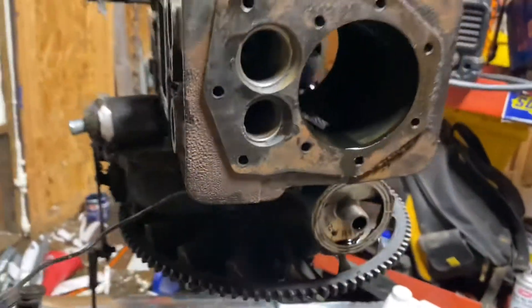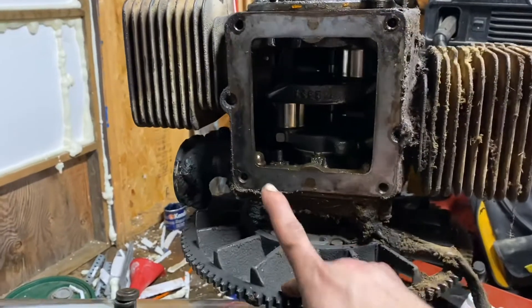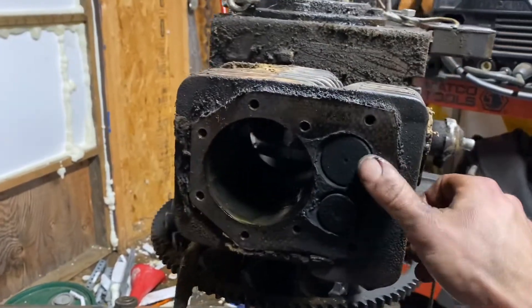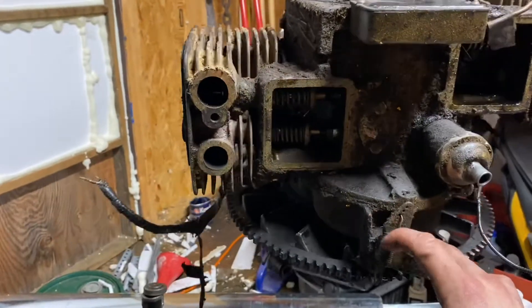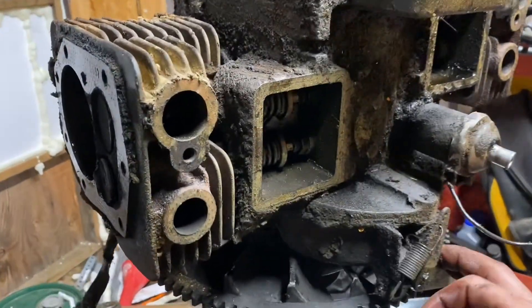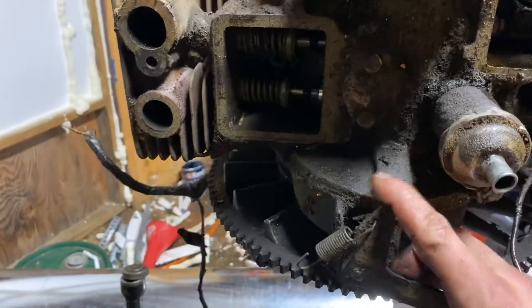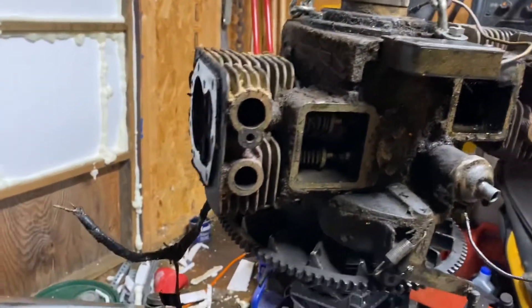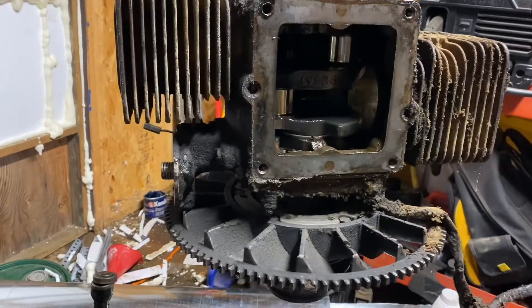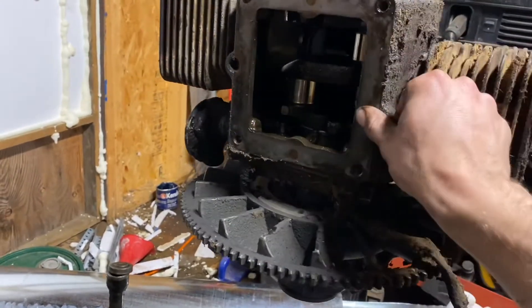This one does not like to light up — I'll have to get my flashlight out to show you guys. I'll check out the bore on them, get them honed out, and order parts. I'll also get a new oil pump while I got it all apart. I'll re-lap the valves and do a valve job on it — look how much carbon's built up. I already took the valve train out of one side. I'll take this valve side out too. I've got to invest in a parts cleaner — I'll end up soaking this entire engine in parts cleaner and get all this gunk off.